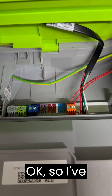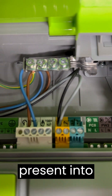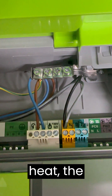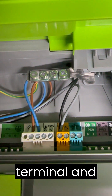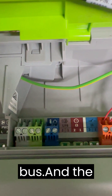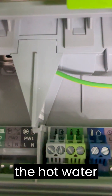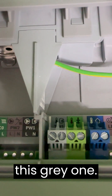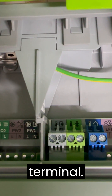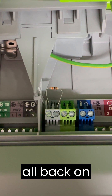I've opened up the boiler. You can see it connects into the yellow screw terminal. The call for heat and the call for hot water go into the same terminal, and over here are the two red wires that go into my EMS bus. The hot water thermostat is this grey one. So I'm going to put the 10k resistor across that terminal. Okay, the resistor is in. I'm going to turn it all back on and see what happens.